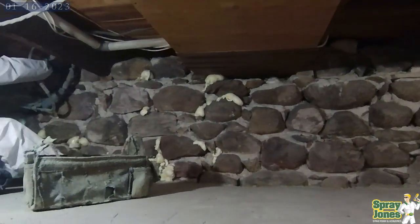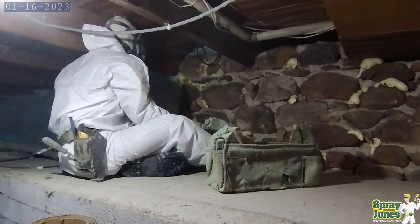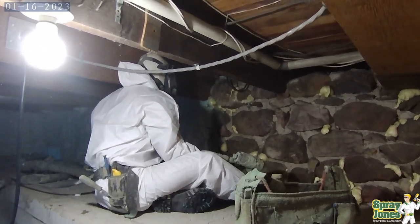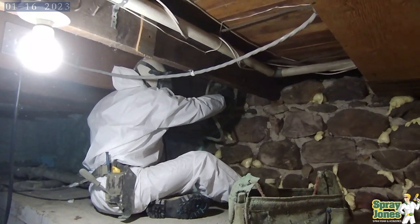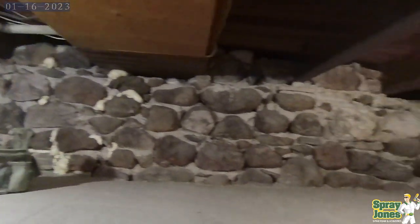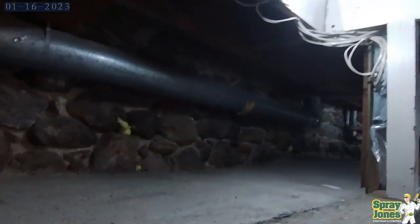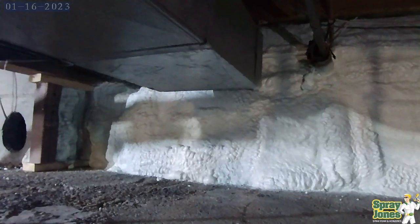The client noticed the air tightness of this right away. The next day after we had completed the job, I followed up with him and said, how are things going? And he said, amazing. He said the first thing that he noticed was the return air issues were gone, the cold air return, that now the air wasn't being drawn through the mortar joints and cheating to come into the house. Instead, they were getting proper draw and suction back down into the basement through the ductwork as they should. So no more issues.